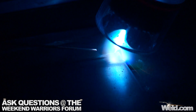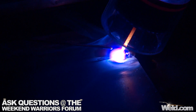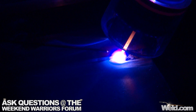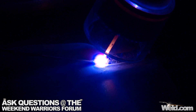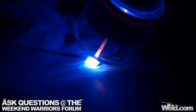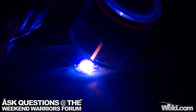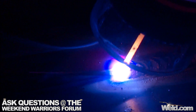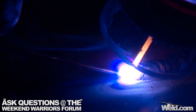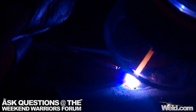There you go. Now the steel is not going to fume, but you'll certainly see it with the brass. The steel is not a real clean steel — I didn't do any major surface preparation. You can see the zinc trying to come out with the brass. It'll pop a little bit, but that's just the way it is with that material.